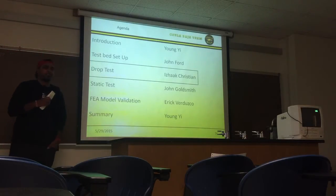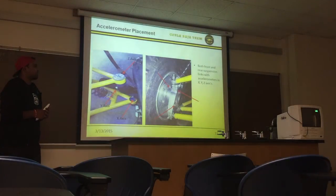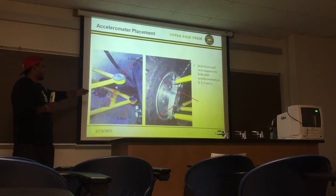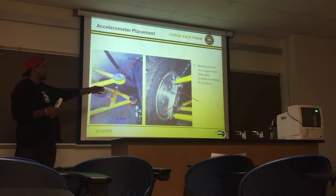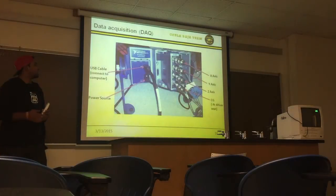Hi, I'm Isaac Christian. I'm going to talk about the drop test. The first thing we did was attach the accelerometers to the car. For the front tire, we did it on the kingpin, and we attached 3 accelerometers in the X, Y, and Z coordinates using the right-hand rule, and in the back spindle, we attached the accelerometers.